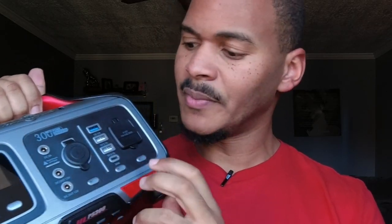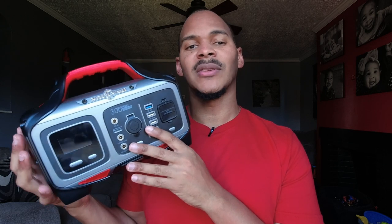Pass-through charging is important because it lets you use your solar power and pass it through into your battery and into your devices. But I want to offer a different perspective: it does support pass-through on the DC side, which I'll get to in a second. If you're not the kind of person who needs to use solar while it's coming in, it may not matter. If you just need a battery backup, or you charge it throughout the day with a panel and use it at night, pass-through charging matters less for your situation.